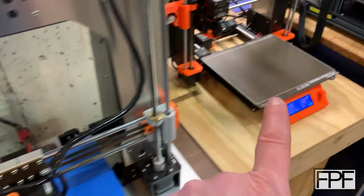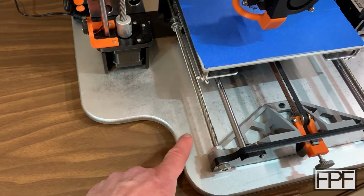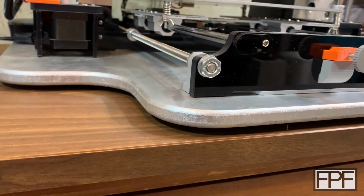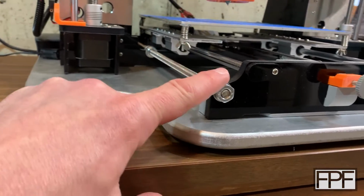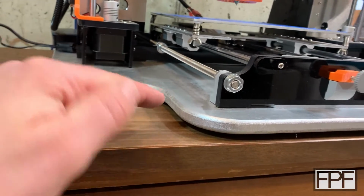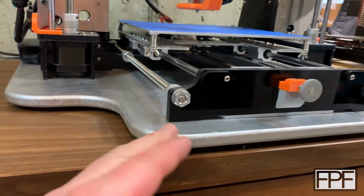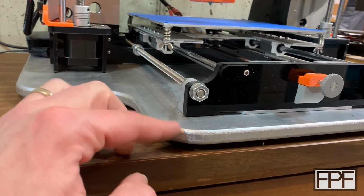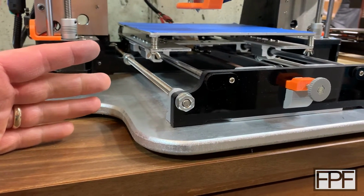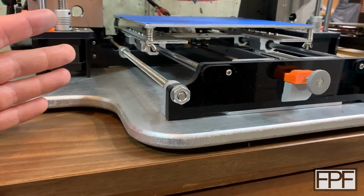When I got the Prusa Mark III and moved this machine, I came up with the idea of just cutting this base out of MDF, and I spray painted it silver. And you do want to go with a fairly thick MDF if you copy this, and I don't have any drawings for this. I think I set the printer down on a piece of MDF and then went around with a pencil and drew a rough outline, and then just came back and made sure that all of the curves and lines were true to the actual frame of the printer. But you don't have to make it as nice as this one. I think I ran it over the routing table to round over all these edges before I painted it. You could literally just stick the machine on a hunk of plywood and screw it down, and it'd be fine. Or if you're not going to move it around, just bolt it to the bench like I originally did.